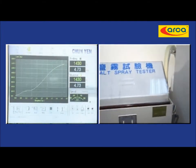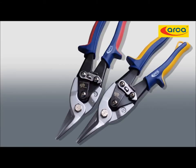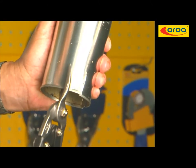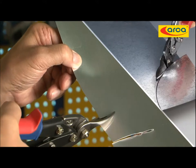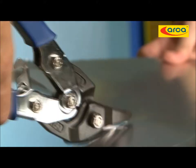There are basically four types of aviation tin snips: a straight cut, left cut, right cut, and vertical offset cut. The straight cut is used for short distance cuts, while the left cut and right cut are good for circular or round cuts. The offset cut helps spread the steel for continuous cutting.